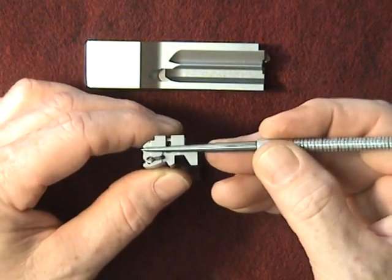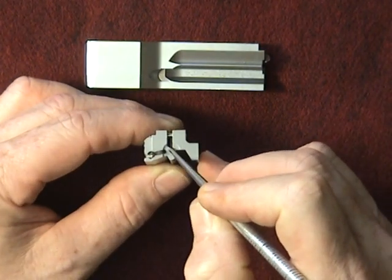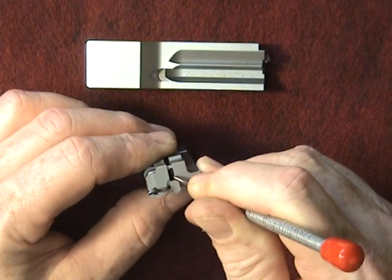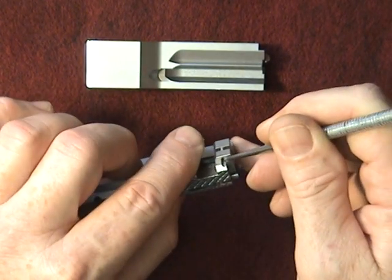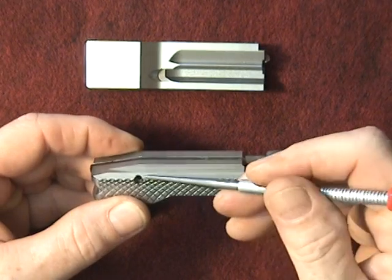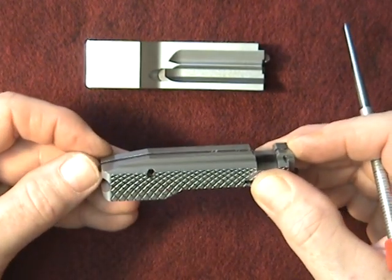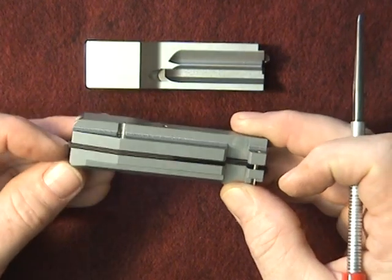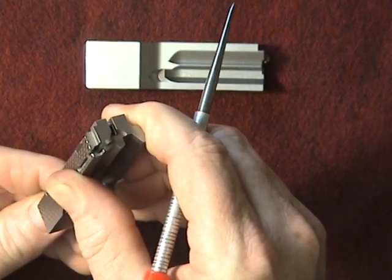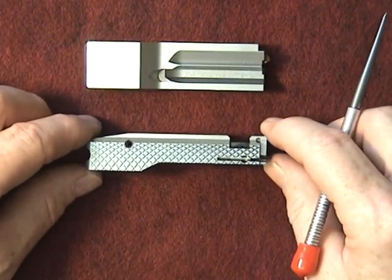The breech face is machined square to the bolt body to within two ten-thousandths, and the headspace is cut to the proper forty-two thousandths. You'll see the nose of the firing pin — it's pinned. We have a three thirty-seconds hardened dowel that goes through here to control the up and down movement of the firing pin. Because we control all the components, the rear of the firing pin is also an extremely close fit. So the rear end doesn't move up and down, the front end doesn't move up and down — the only movement of this firing pin is fore and aft. That allows thirty-five thousandths protrusion, which is exactly what you want on a 22 rimfire, giving you proper, very consistent ignition and making for an accurate rifle.